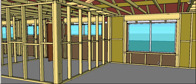As you can see, we're out on site and inside the house today, and what I want to show you in this video is the procedure for doing what I call a pre-sheet. This happens just before you're about to sheet your internal walls, and all it is, is going around and checking that all your walls are plumb and straight, and how you actually fix them if they're not.